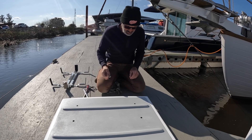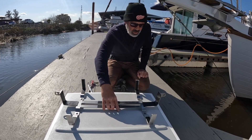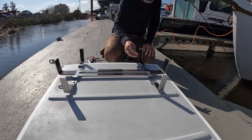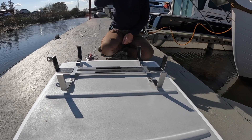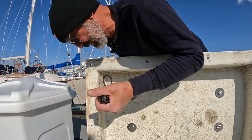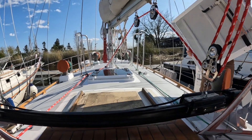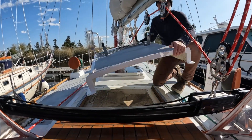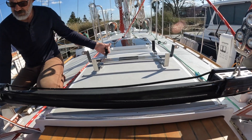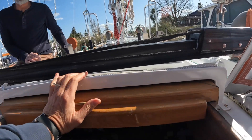All right, so I've got all the bolts modified — the nuts go on top. Now I just have to make little balls of butyl tape and wrap a little twist of butyl tape around each bolt to seal them off, and then I can tighten this thing down. It doesn't rub.